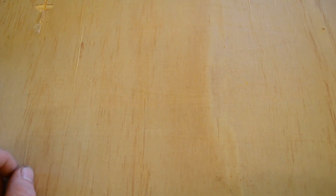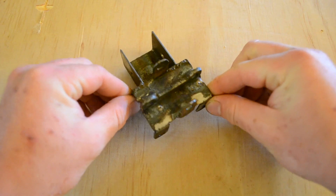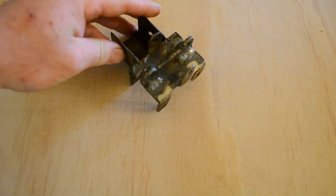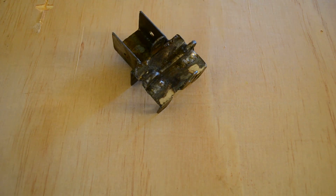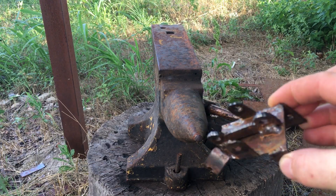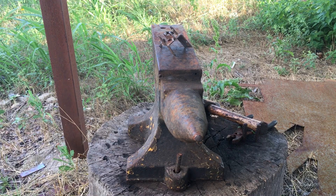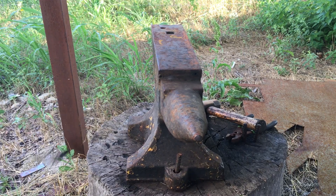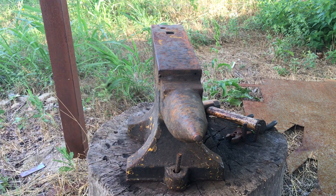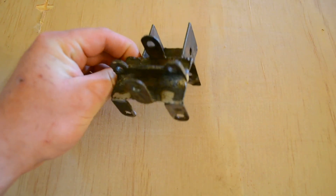The second time, I broke each individual fitting into a whole bunch of different pieces that I clamped and welded together instead of bending them, and this ended up being way more accurate. They aren't the prettiest welds, but I'm pretty sure they're functional. I ended up testing some cast-offs by beating them to death with a hammer, and they did pretty good — they bent to some pretty extreme angles and never broke, so I think they're pretty safe.